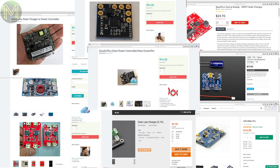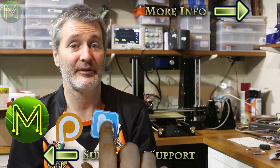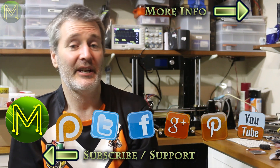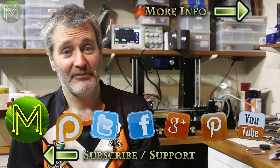Another thing to take into account is battery temperature. LiPo batteries tend to not charge well at lower temperatures. This Tindie store has a solar charger that is a bit expensive, but it monitors battery temperature and will heat the battery prior to charging if it's too low. Like anything, there's always a trade-off between cost and efficiency. Hopefully that has given you a brief introduction into solar cells. In a later video, I'll be taking a couple of these boards for a test run to see how they go. Thanks for watching. See you next week.